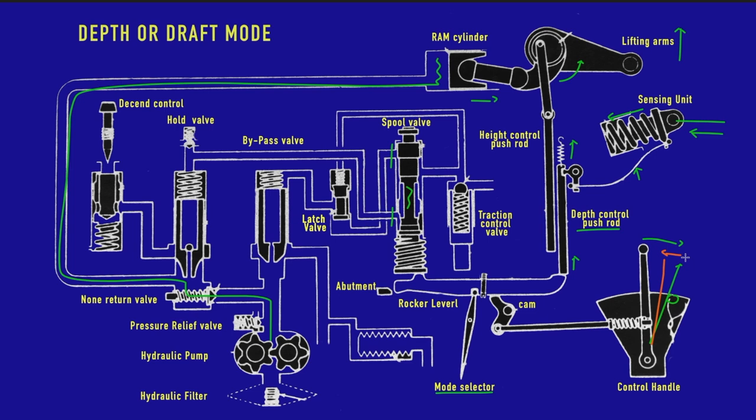In hold mode we pivot the cam again, which stabilizes the lifting arm at a certain height. The plow has been raised to a set height and now we want to stabilize it. The cam moves and the spool valve plunger goes toward the holding position — in this position, oil from the hydraulic pump must come through the bypass valve, through the passageway in the spool valve, and out back to the sump. The hold valve passage remains closed, so oil cannot leak back out of the ram cylinder through the hold valve.